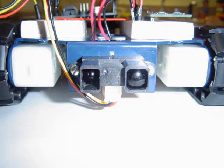On each of the motors there is a positive and negative lead. By running a current through these leads, the motors will spin. Likewise, if you run the current in the opposite direction, the motors will also spin backwards. How the range sensor works is, it sends out an infrared signal, then records the time it takes for the signal to return. It then sends that time reading to the Arduino board, which can be utilized in a program, such as the one I have written for this rover.